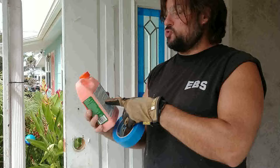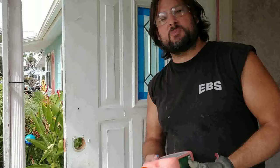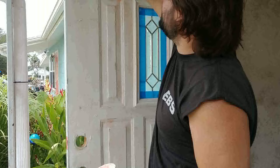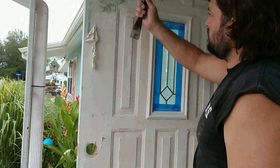It wants you to use paint stripper wash or odorless mineral spirits with an abrasive stripping pad to loosen remaining residue. Allow the liquid to evaporate and residue to dry outdoors, then dispose in accordance with local, state, and federal regulations. So when this stuff comes down onto the plastic here, I'll let it dry, wrap it all up, tie it up and dispose of it properly. I've applied a full coat across the door. What I can see already is the paint is starting to peel up — there it is where it's water-based paint. I don't see any of the oil-based lifting just yet, but I'm guessing that's going to take a little while longer. So I'm just making sure it's a good thick coat and then we're going to leave it and let it sit for an hour or two.